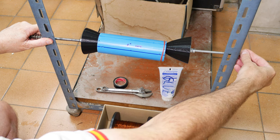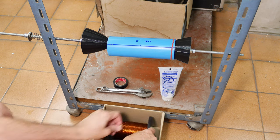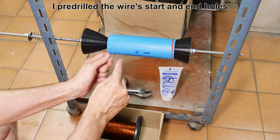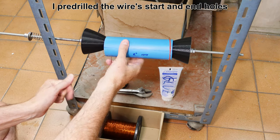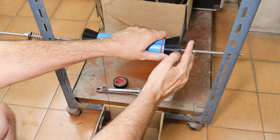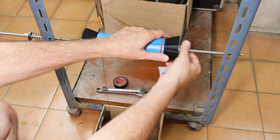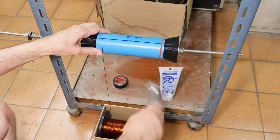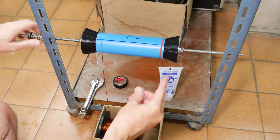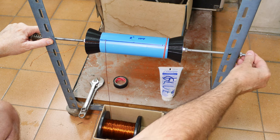I take my wire out of the box, put it through a hole I've pre-drilled in the pipe, and pull out quite a bit of wire. That way when I pinch it off it helps hold it in position. Then I pull the cone over, put the washer in place, tighten everything down with tools to get them really snug, and lock them off. Finally I finish this side with the necessary second nut and lock that off too.